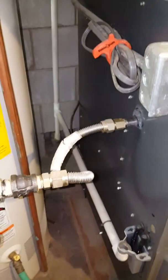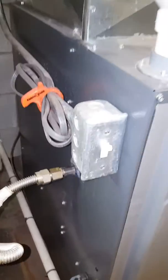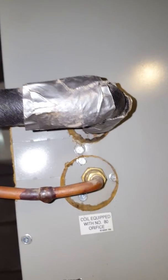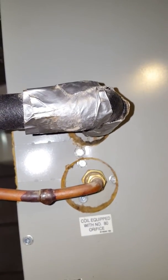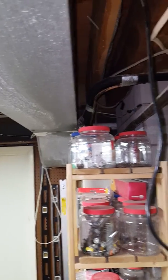It does have a three-quarter-inch condensate line that is going back into the plumbing in the wall there. Gas line — there's your shut-off here, so it's not going to need any shut-off. It's a three-and-a-half-ton coil. It's got three-eighths by seven-eighths line set that goes back and runs through that area there, and it is finished on the other side of that wall, so we'll just be cleaning that line out.